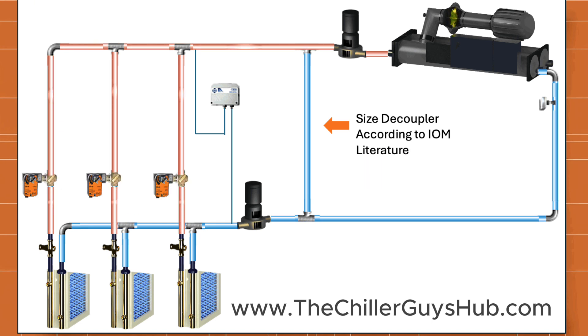On the decoupler line, the most common setup uses a control valve that needs to be configured during commissioning. Typically, you slowly close off that decoupler valve as you speed up the secondary pump — as the secondary pump approaches 100%, the control valve on the decoupler line slowly closes to 0%. This needs to be fine tuned depending on the valve selected to ensure the chiller is never starved for water across the full range of operation from zero to one hundred percent. Take the time to do it right.